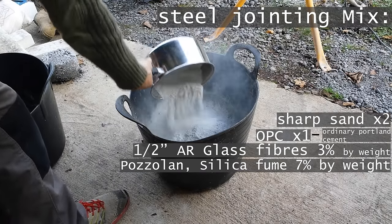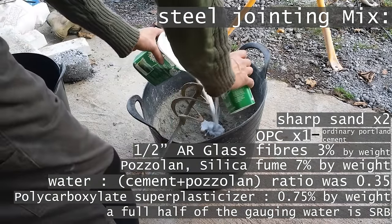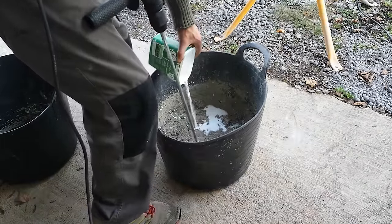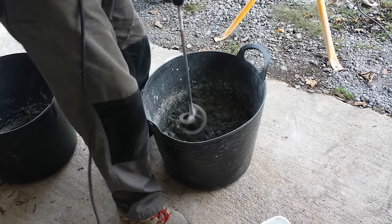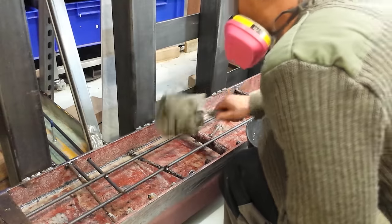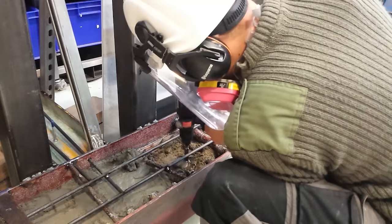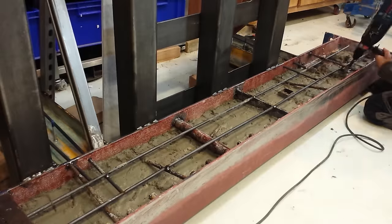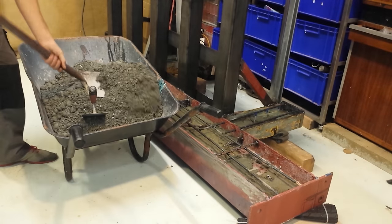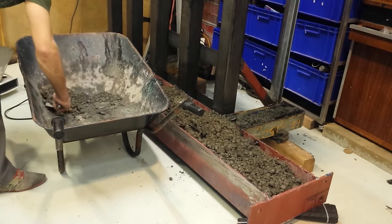One of the funny quirks of concrete conventions is that the cement-aggregate ratio is measured by volume, and the rest of the things are measured by weight, against the weight of dry cement powder plus pozzolan. One big hurdle for concrete use in machine tools is that it tends to shrink, but this problem can be minimized by reducing the amount of water used. Reducing the gauging water also reduces workability, which is where super-plasticizer and consolidation tricks come in. I was initially aiming for a water-to-cement-plus-pozzolan ratio of 0.28, but after testing it, about the best I could manage was a ratio of 0.35. For more on mix design I'll write up some of my research and leave a link in the description. The main mix now has stone: one cement to one sharp sand to two stone.